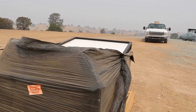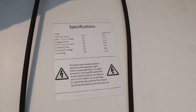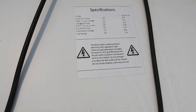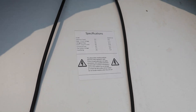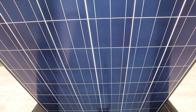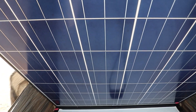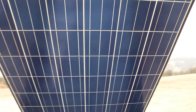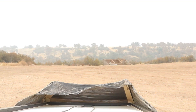Let's take a look at these panels. I will do my best to get you a good shot on this name plate. You can see these are 250 watt panels, 37.6 volts open circuit, and 8.27 amps at maximum power. You can see these things are in fantastic shape — there is pretty much nothing wrong with them, next to no imperfections. The fact that they're used I don't think even matters, because of how great a shape they're in.